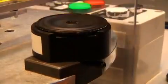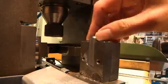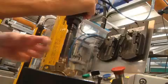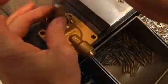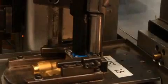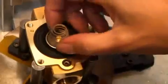The diaphragm parts are flanged together. The seat plate is mounted in the armature and the production number is stamped on it. The equalizing orifice and the armature system are mounted on the valve cover. The pilot filter, diaphragm, and spring are mounted in the valve cover.